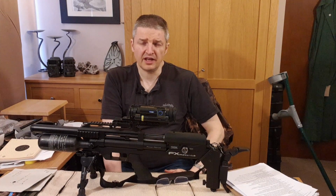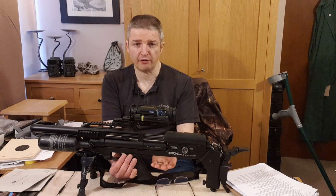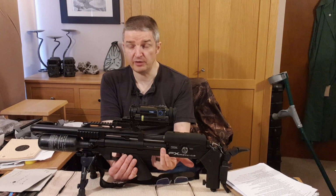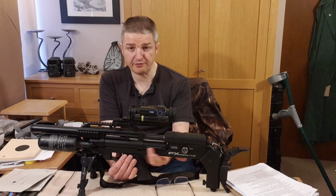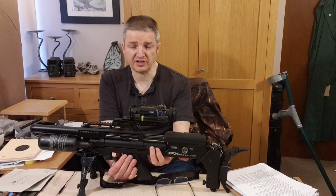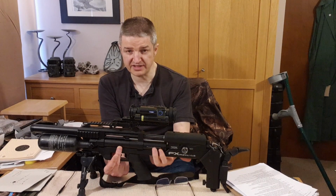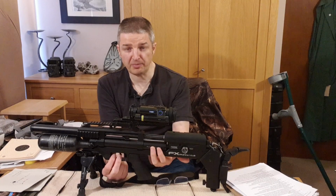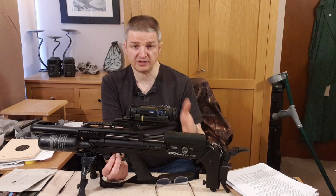Right, at this point, from Matt Dubber's video, he had mentioned something you've got to watch out for. When the power plenum is only running about 50 bar, well, he was talking about higher pressures, maybe even 80 bar, but he said certainly when it's running around 50 bar, UK 12 foot-pound levels of power, you can get circumstances where the reg 2 is not actually able to detect the pressure drop from a shot. So reg 2 might not top up the power plenum after one shot ready for the next, and it might only top up the plenum every 2 or 3 shots.